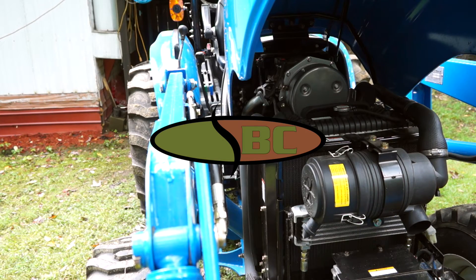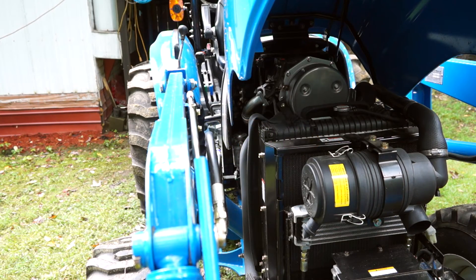We have 10 hours on this LS tractor, and my final task was mowing the lawn when the fuel light started blinking. I had to look it up, and according to the manual, that means there's water in the bottom of the fuel filter. It's not really easy to videotape where that is, so I'm at the front of the tractor and I'm going to zoom right in now.